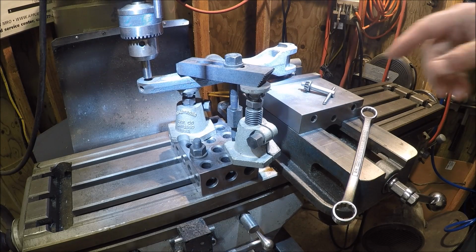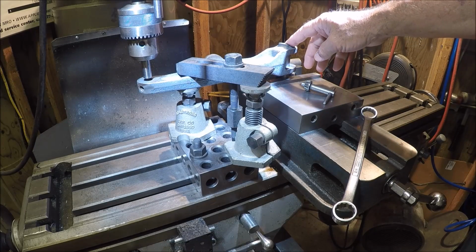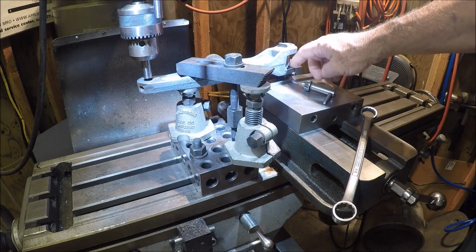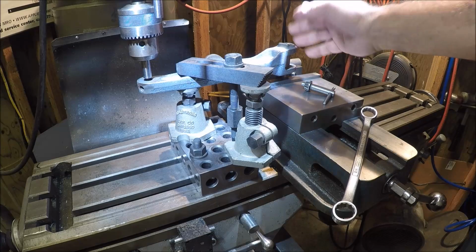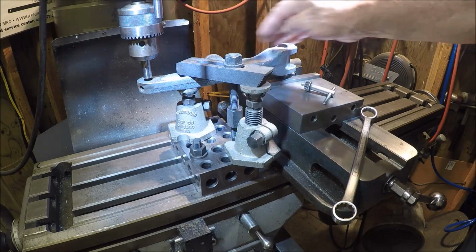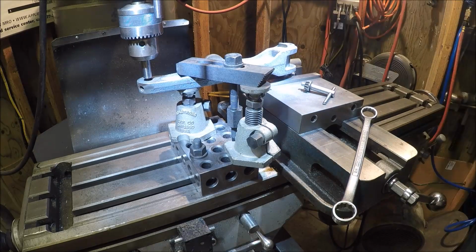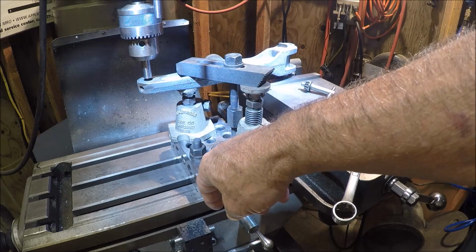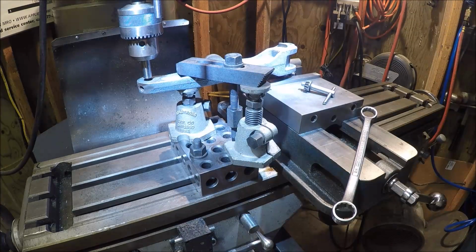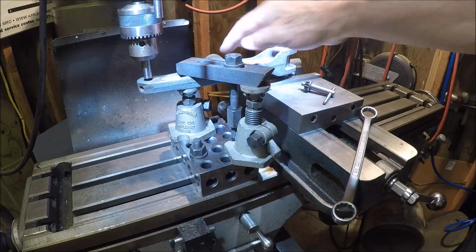So what I've got here, and I'll move the camera after, is a V-block. I've got a pin in this back piece here, and a V-block so that the pin's attitude is 90 degrees to the table, perpendicular. That helps me align the unit in both directions. Then I came over here and put down a 246 block just for support. And recently I picked up these Armstrong jacks, and they both have balls, so they move. Nothing on this thing is straight.